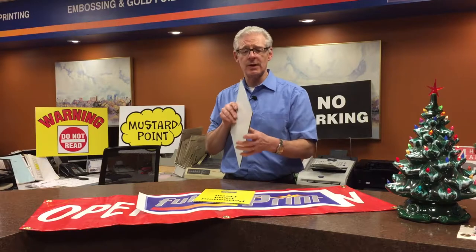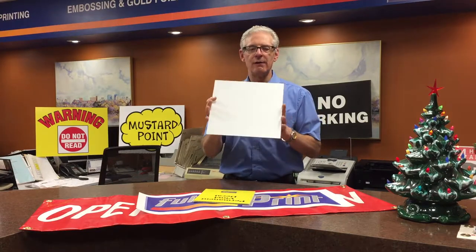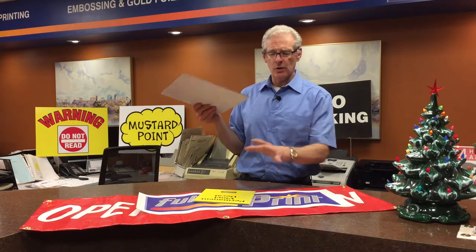The fourth option is kind of my favorite material. It's called dibond — composite in the center, about an eighth of an inch thick, with aluminum skin on both outsides. It's very smooth and painted white. It comes with a protective material we just peel off and put the sign right to it. Clean, very nice. Easy to drill some holes in and put onto a construction site. It doesn't warp — it's just fantastic material. It's not that thick but it's nice and stiff; however, it's good to put a backing of plywood or something on it. This is the most weather resistant — and going down the list, it's probably the most expensive of the four.